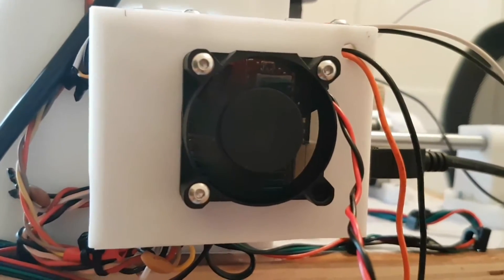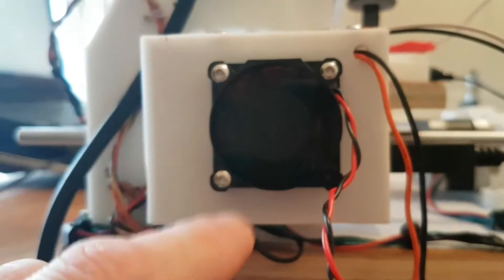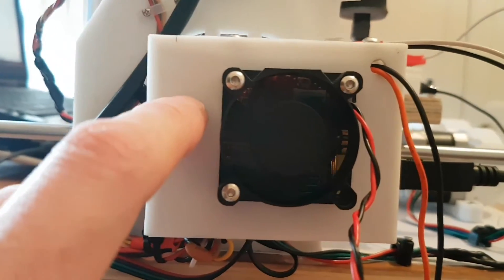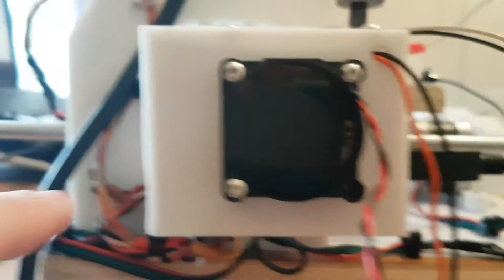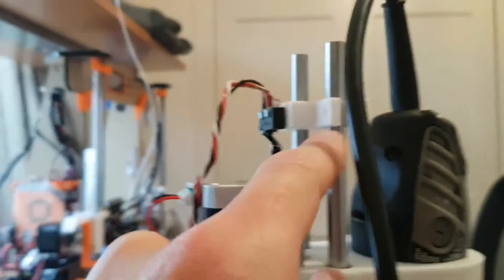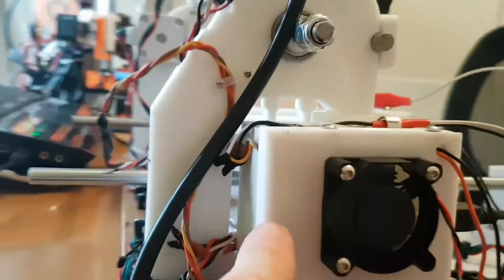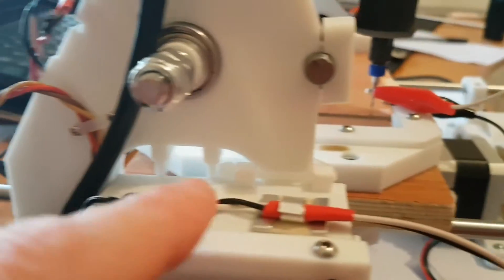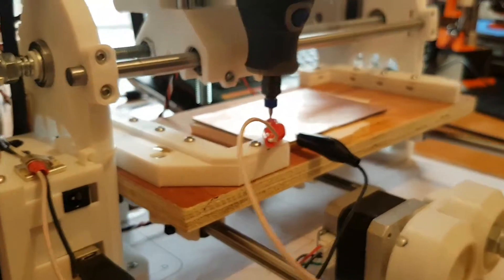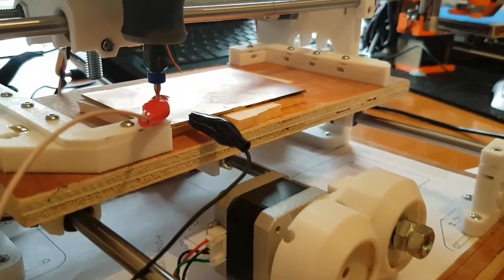Stepper drivers, and that is a version 2 board. So what that has got is it has got the X, Y and Z motors on the stepper motor pins as usual. And then it has got limit switches - I have actually got it buttoned up at the moment. It has got X, Y and Z limit switches and they are all paralleled together so that it can have stops on each end. I have just got one on the home. That isn't in the plan; I did that because it wasn't easy to home it without that - that is the Z on the Z Max. On pin A5 it has got these two wires. I have pulled them all up to the 5V line with a 4K7 resistor just to hold the pin high. Basically that pin is held high until it contacts the ground which is on the copper clad, and that is the probe switch.